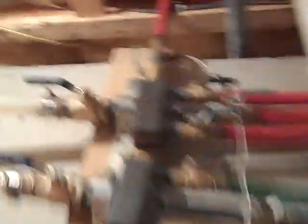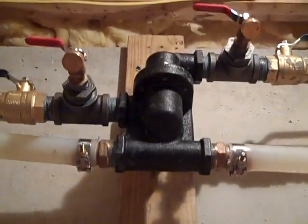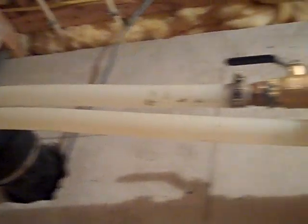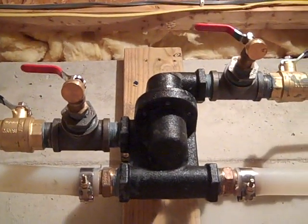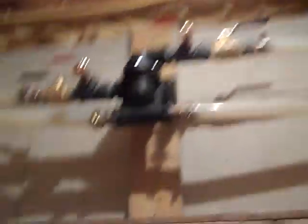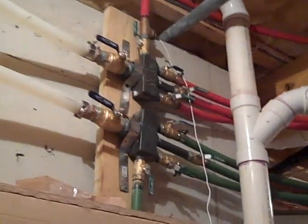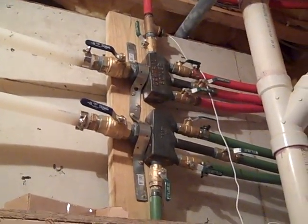It's kind of complicated, but you have a thermostatic valve and this works like a heart — it shunts the water back to the boiler if the temperature isn't hot enough. It has three internal temperature settings, so if you forget to put wood on the stove or the stove goes out, it keeps the heat back at the stove and will not let it go to your emitters — that being your water heaters and your air handlers.